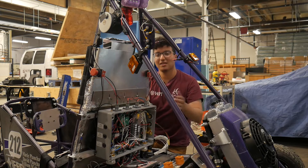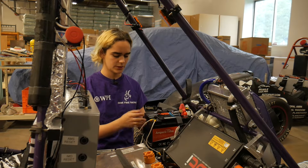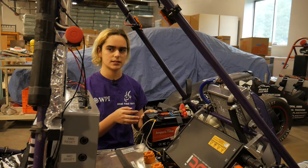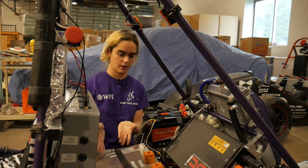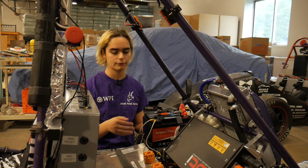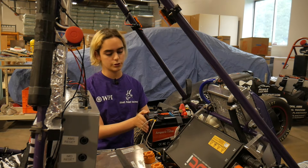Tractive systems equals high voltage, so whenever you hear TS, that's high voltage. This is the grounded low voltage battery for our system — we typically refer to that as GLV. It's really big because we don't have a DC-DC converter on our car. If we did, we could convert from the high voltage battery down to the low voltage needed to charge this battery. But since we don't have one, we have this big GLV battery, and it outputs 12 volts.